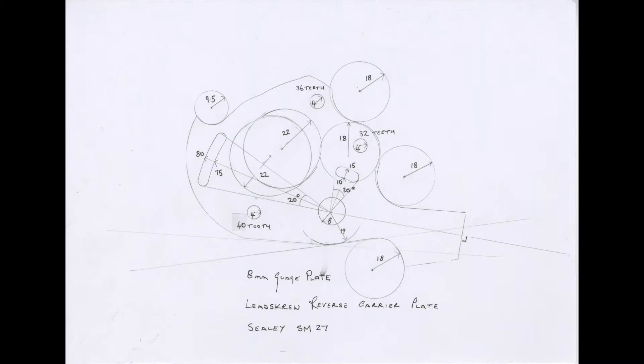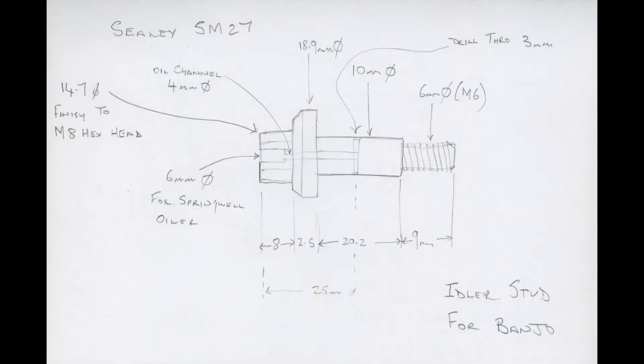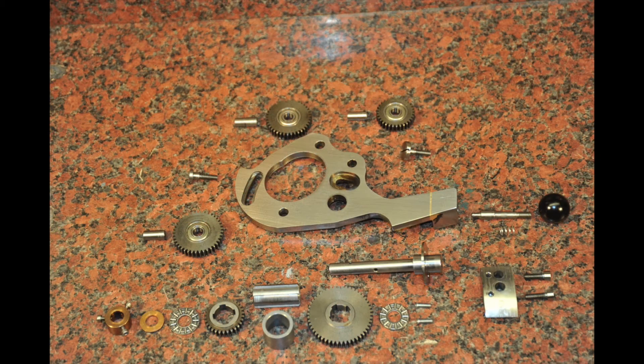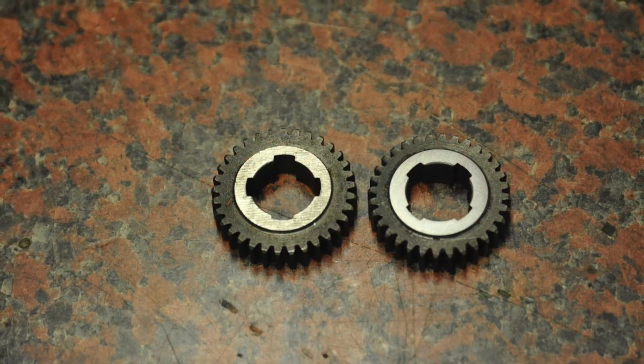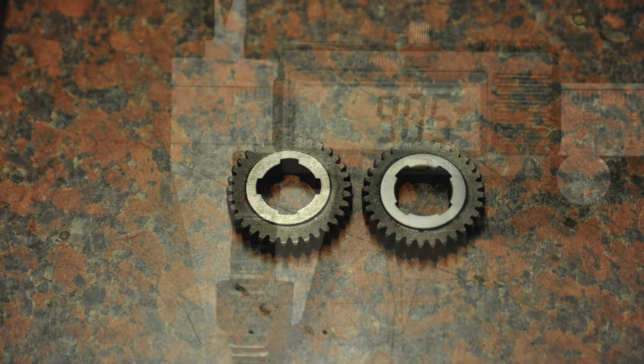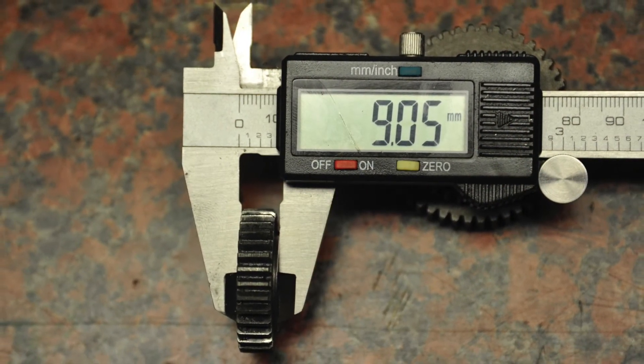To get the idler gear positions I put the whole thing together, super glued the idler gears in the correct place, then drilled through. I made a new stud for the lower gear change banjo — drilled and cross-drilled it for oiling. Somewhere around here it starts to become a bit of a brain teaser; there are heaps of bits but if you go at it one by one it eventually comes together. The spare gears I bought I had to reface because they were too thick — I bored some of them out and made press-fit bearings. None of it was drawn out by this stage, I'm just fiddling and winging it, but the concept was sound.